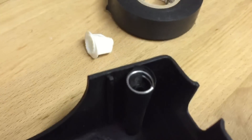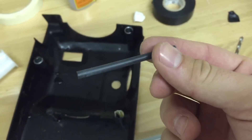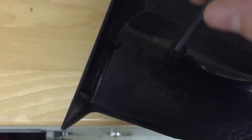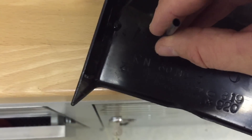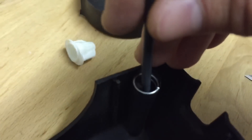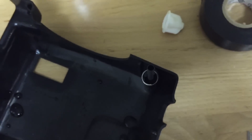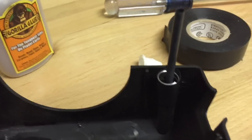You need something to hold the place of the screw hole so it doesn't get filled up with the glue. This is just some heat shrink wrap that I had, and it worked out really well. You can get it in different sizes — you can see it fits just perfectly right in there. It'll keep the gorilla glue from sealing up the screw hole, so put that down in there and trim it off or do it later.